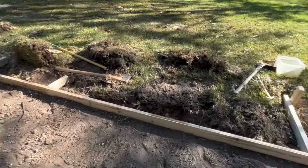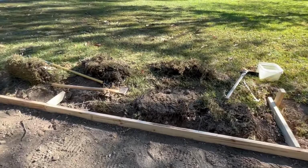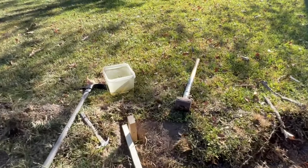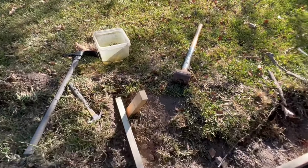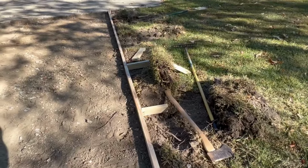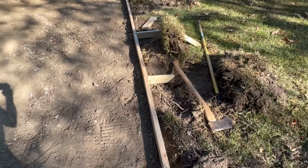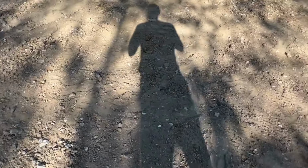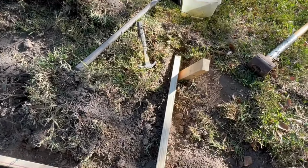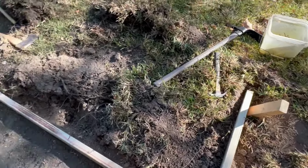And I got this form set. It's pretty much exactly where the edge of the concrete was. And I cannot get a stake in the ground. The ground is hard as a rock. I can't get them in. They just go a ways and they stop. Now, along the form board, I think there was a block structure and it may be a footing for it down there because I'm digging up all kinds of pieces of block. So I thought if I'd put these little offsets like this one, I'd get out past that, but that didn't do any good. That stake won't go in either.